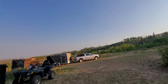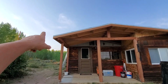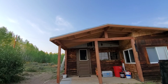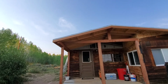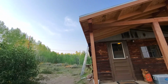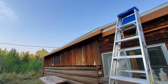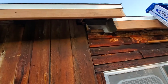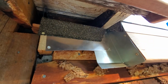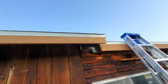And then you may have noticed, that's my truck and trailer. And then you may notice all new fascia. These are actually deck boards. They're 5/4, so they're 5.5 wide and an inch thick, and all new drip edge, ridge cap, and roofing. It had a rolled-on shingle roofing before. There's some custom detail here that I did to accommodate the design where they tied in before. I had to basically custom build all of this out of sheet metal, and it turned out very nice. It's going to be very good and functional, and snow loads up here are pretty high.